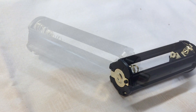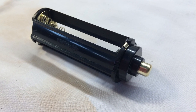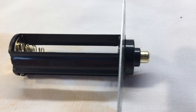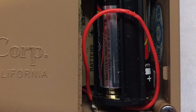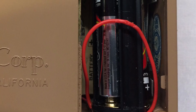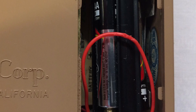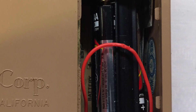Not having much room to work with, I went back with a cylindrical battery holder, a torch-type design. It holds three AAA batteries. I had to do some modifications and cut that top piece off where you see my ruler, soldered a positive connection on to that point, and was able to butt the negative post up against the existing negative connection on the holder. So that's it and we're good to go.